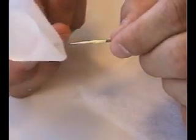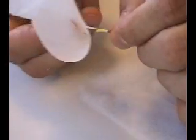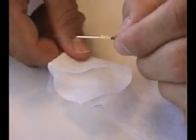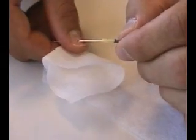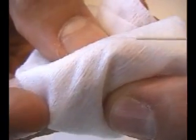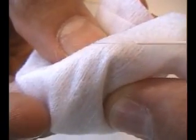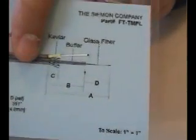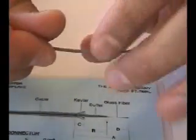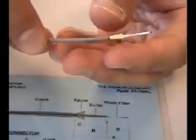Using a dry lint-free wipe, remove any remnants of the protective coating on the fiber after stripping the buffer. Note that it is important to ensure that all remnants of the coating are removed or the fiber will not fit into the connector. Also, be careful not to touch the fiber after cleaning to ensure a proper bond. For jacketed fibers, be sure to double check the marks since they may have moved. If required, adjust the cable as necessary.